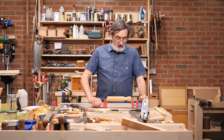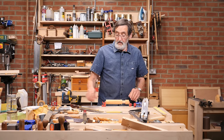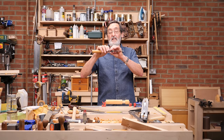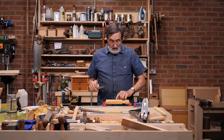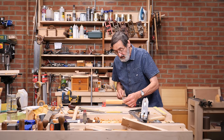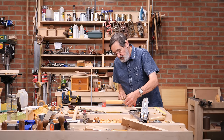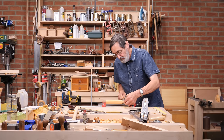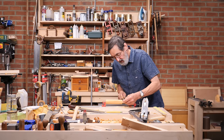Okay, so I'm going to clamp this and cinch it tight, and then clamp the pair in the vise just like that. And this is where I'm going for this small rasp because it works so nicely, and it's the thickness I need. It's an eighth of an inch thick. So when I rasp down and get this level with the sides on here, like this, I know I'm already down to depth, and that's going to leave me with the exact size diameter in that midsection. So this is what I'm doing. And I work to that pencil line that I put on there as my guide. When I hit the pencil line, if I'm still above the surface, I move it further towards the main handle, like this.